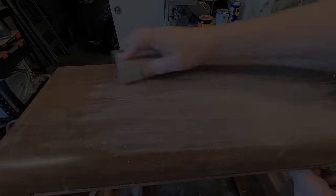I'll apply the stain and then I can polish it off. You may think I've made a mistake with the editing and put old video in - unfortunately that's not the case. This is the way the radio is now - I've stripped it back again. I was just going to put a top coat on to cover the bit where I'd gone through, but a few days after I'd put the top gloss on I came out the night before rubbing back and put my multimeter on top of the finish and it sunk into the finish. Then I sat a poly bottle on top of the finish and left that overnight and it left a mark as well. At that point I thought this is no good - having the semi-gloss underneath and then putting the gloss over the top, two different paints, it wasn't working. So I've stripped it back. I'm going to re-stain it and just use the clear gloss acrylic - I've used this many times and it's perfect.